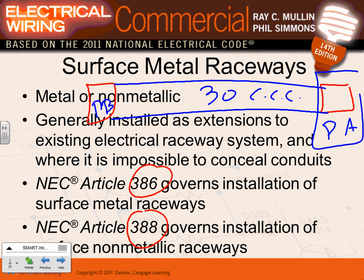That's one of the key advantages for metallic raceways over conduits — with some restrictions. So if I want to take 30 branch circuits from point A to point B, say 50 feet or 20 feet, that could be a great application. Keep in mind: where would you use them? These are dry location only, though some are rated for other locations like EMT can be used outside.